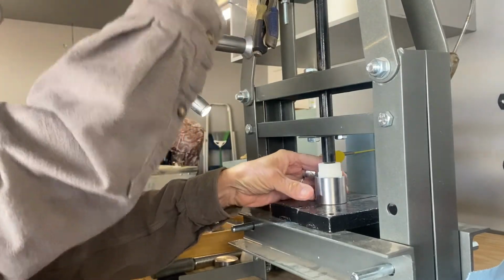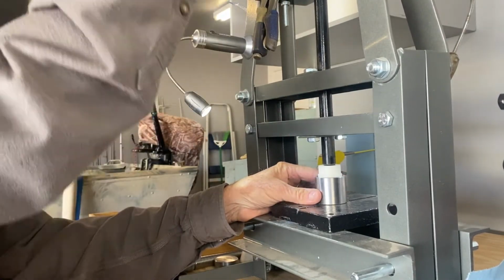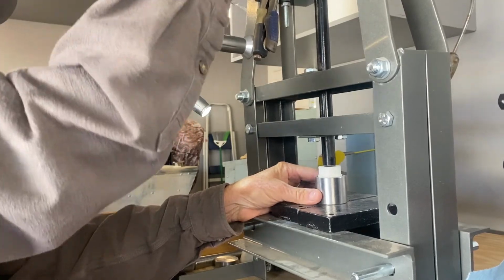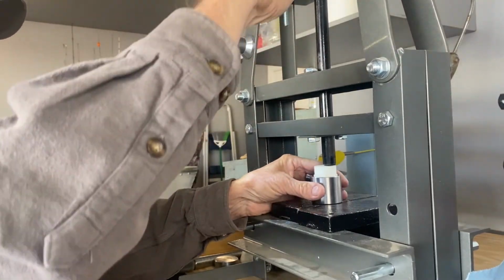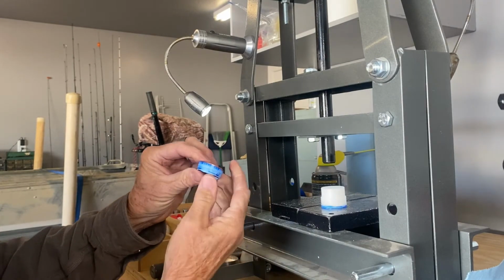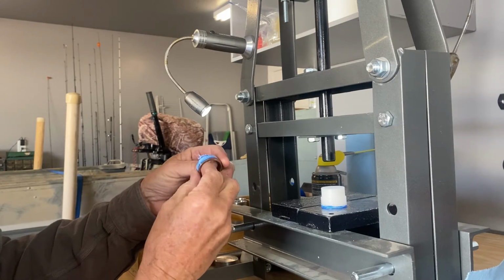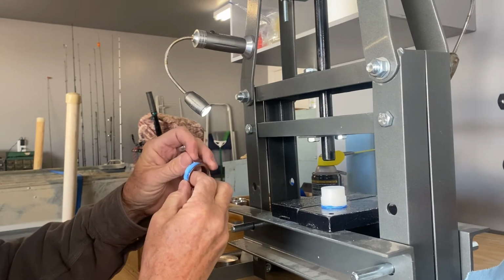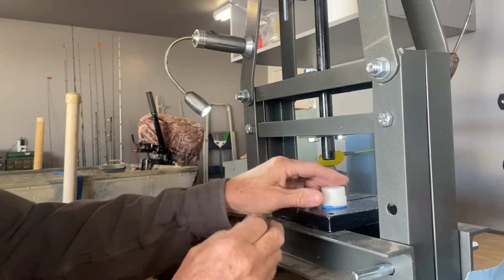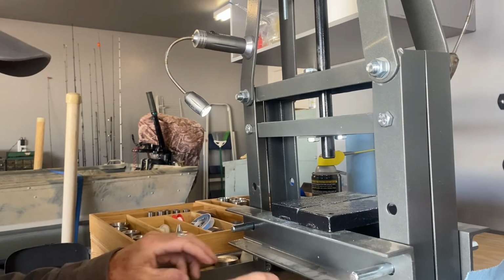Pushing, Swedish wrap, pushing down as you can see. Pushing it down in there. We're gonna try to take the bow out of that. As you're pushing it down your Swedish wrap, you wanna look, you see the detail coming through that says Vietnam Veterans. You can start to see the date coming through there. Okay, we can probably push a little bit down there, just a little bit more without worrying about hurting the detail on there.